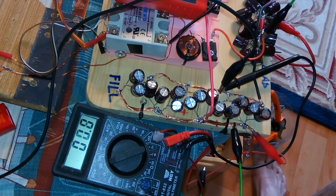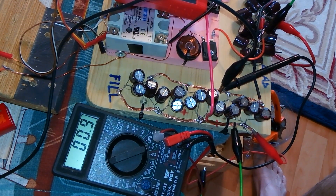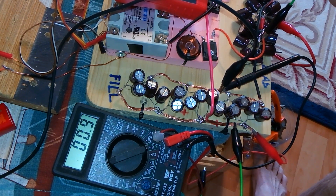So what I did in the test before: I had the generator coil output, eight coils, and I had them all in parallel, so it only made about 10 volts. And I ran the back EMF flyback recoil recovery in series to that, so I had a combination of two power outputs filling the caps.